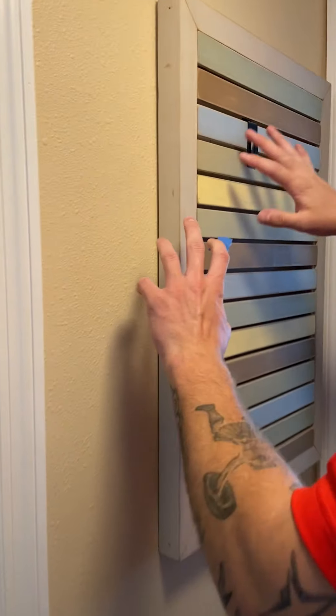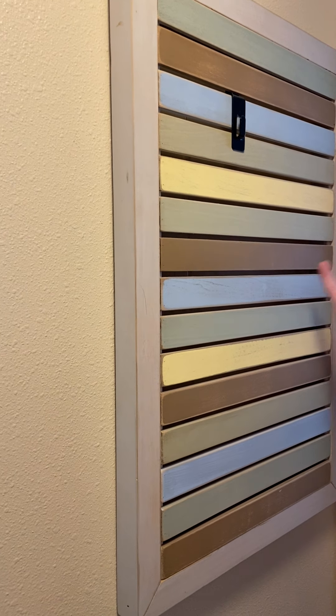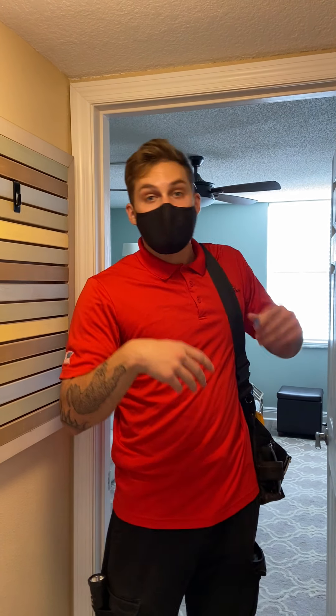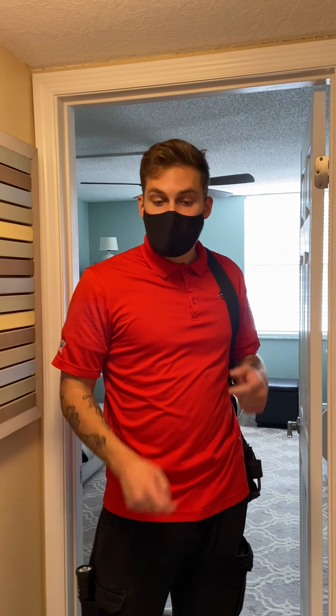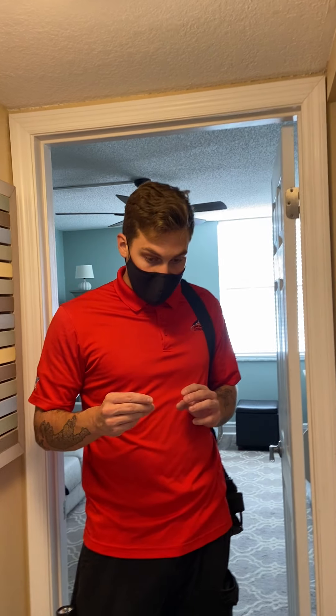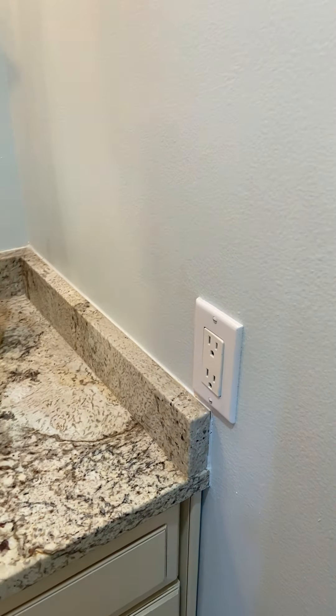The only things here were some interior corrosion - I've got pictures of it so you can see it in the report later. It's just a sign that some moisture is in the air, because there's some rusting inside. It could be humidity or salt in the air. It's not a big crazy concern, but something you'll want to get evaluated and try to prevent from continuing.